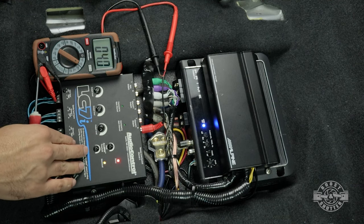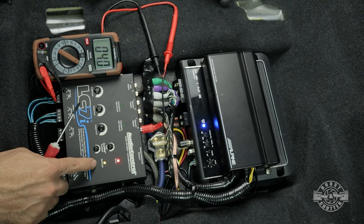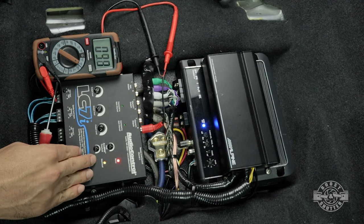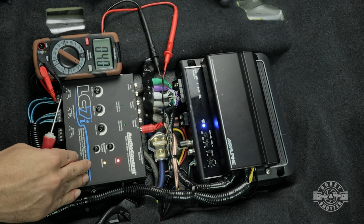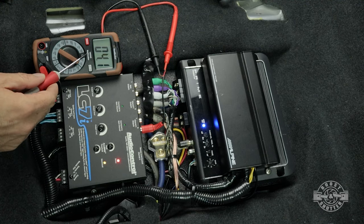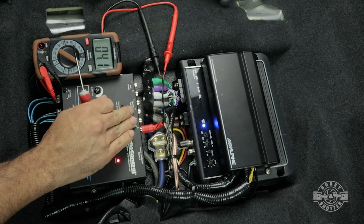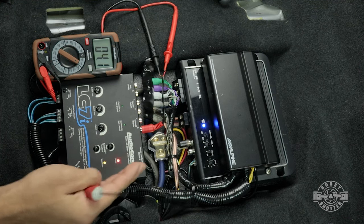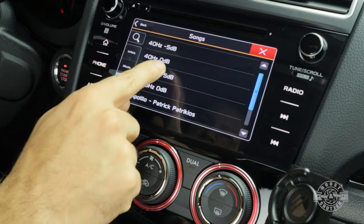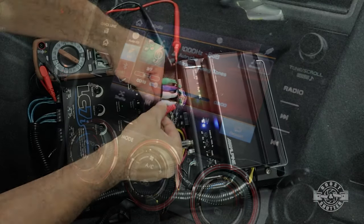I went past it — 4 volts, so I'm good. This particular line-out converter has a 'maximized' light that lets you set the gains just by sight, telling you when the output is starting to distort. I'm going to go ahead and ignore that maximize light because it's meant for music — since I'm playing a tone, the tone is way more likely to trigger the maximize light than regular music would be. So right now at 75% volume I am outputting no more than 4 volts, and I know I'm not going to be feeding the amplifier a signal it's not meant to reproduce.